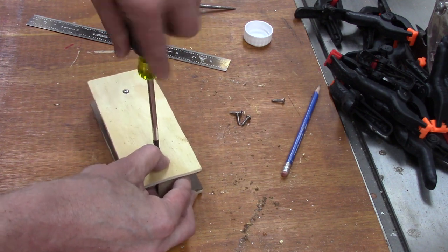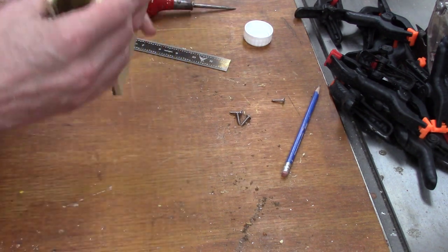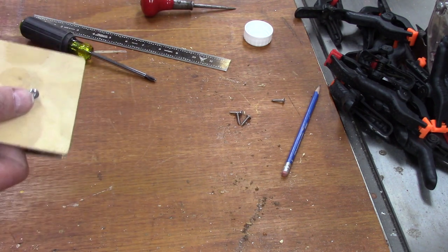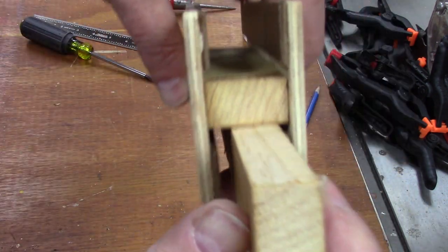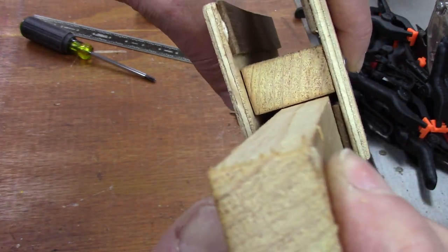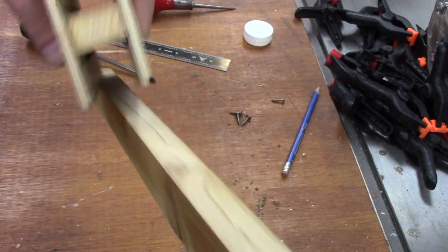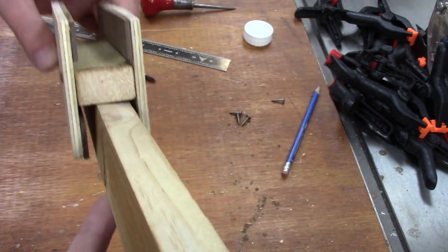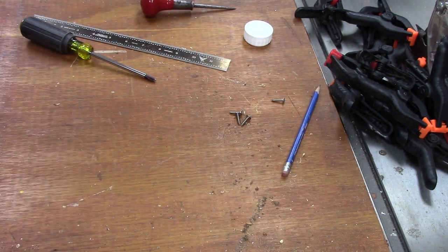A lot of old woodworking books show the wood plane was used for removing mill marks and defects in wood back in the old days before we had belt sanders. So let's say this is a piece of wood you want to smooth, and as you can see, the masonite keeps the stock centered on the sandpaper. So now in a few strokes you can get your wood smooth the same way you would with a wood plane and without all the maintenance of a wood plane.